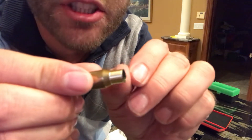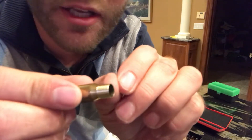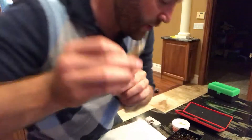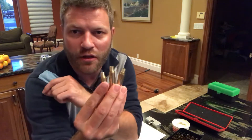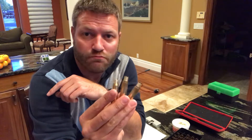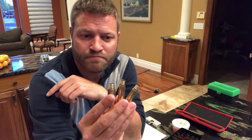The other thing to check: use your fingernail and run it up and down. You don't want to feel ridges. If you have ridges it means you went too quick — put it back on the mandrel and keep turning. You want it nice and smooth and uniform. I've now done four cases. I'm going to go through and turn 20 on this first round, get out and shoot them, see how it feels, and maybe take a little more off next time.